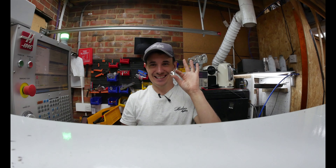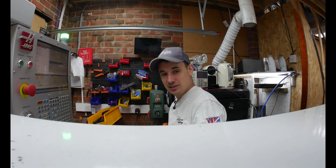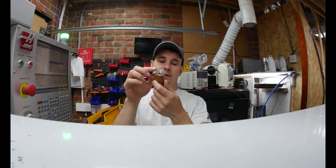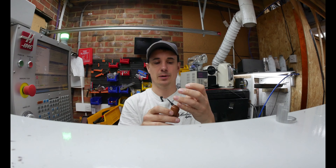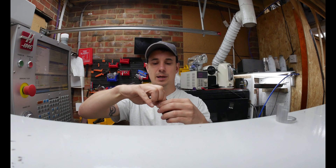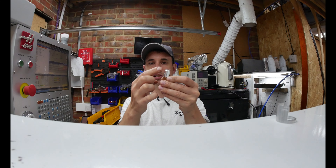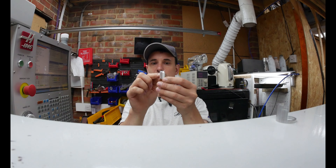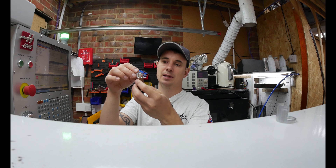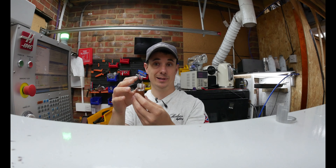Hey guys, today I'm doing some glare guards. A while ago we machined some new tops that are going to be part of a zoom light, which we'll do a separate video on. This is the initial design for the glare guard. What I'm doing at the moment is tweaking the design so it provides a better overall finish. Max suggested putting a chamfer on there, which I've just done. I'm trying to get rounded corners around the top edges, and then we need to start checking the O-ring fit, because basically this is held on by an O-ring.